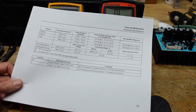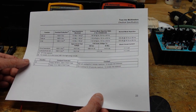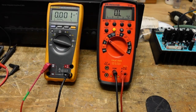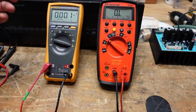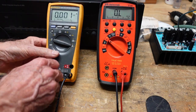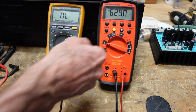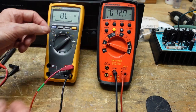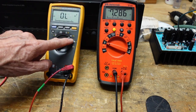This is all I really wanted to cover — I wanted to give you an idea of how these meters do what they do so you have more confidence in your measurements. Your AC and DC input impedance are greater than 10 megohms, so these aren't going to disturb your circuit. In AC or DC voltage mode you can go across the power supplies in a stereo you're testing — not going to hurt anything, no danger of shorting anything out. Also, the diode test mode puts out enough voltage — about 7.2 volts — to turn on any diode or transistor junction, and you can actually light LEDs in diode mode.